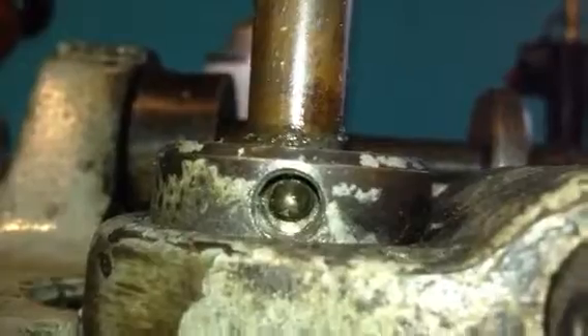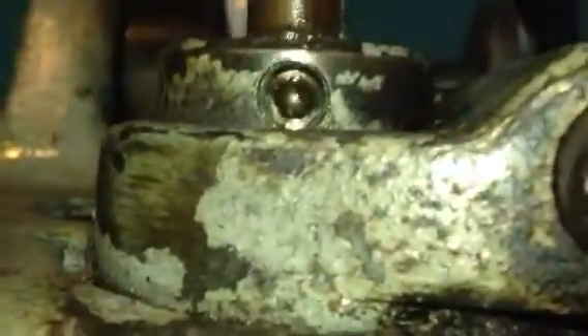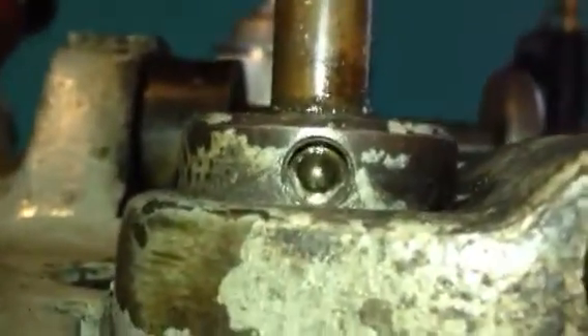What I'm doing now is trying to figure out how to get this little ball bearing out that is stuck in the forward reverse knob for the feed trip plunger. This holds the clutch, so I'm trying to get the clutch out, but this little BB will not come out. I removed both set screws in the spring, so what I'm thinking I'm going to have to do now is try and get this out maybe with a magnet, because I've got a little probe here that's just not wanting to do it.